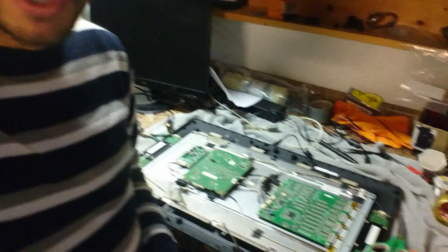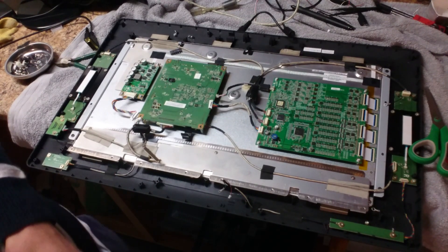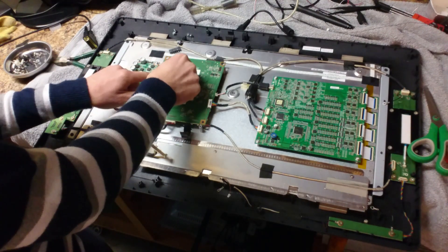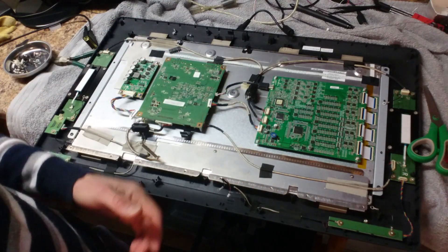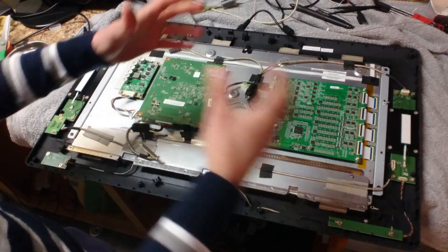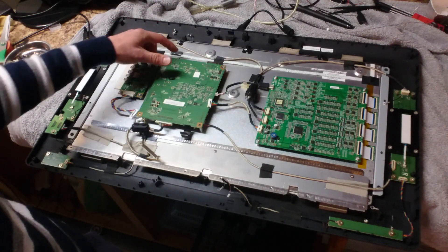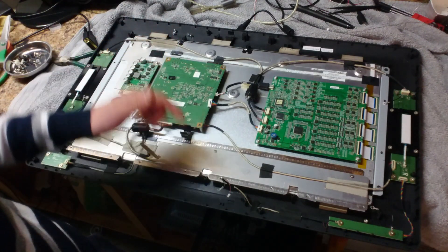So again, this fixes those two problems. Right now I'm just going to replace one so you can see the soldering process. For this one I use a little bit more temperature and a little bit more airflow. I've got my chips ready to go. I kind of just work in the board because I'm using low-flow hot air — it's easier to work with it raised up rather than make your own contraption. Also, make sure you take out the plug. Always take out the plug — I don't always take out the plug. It's bad.